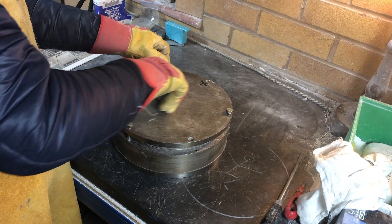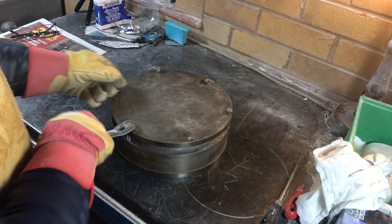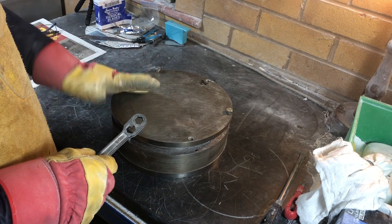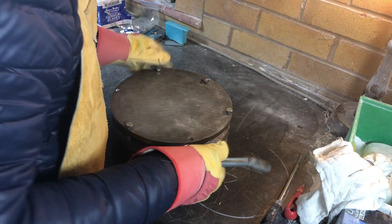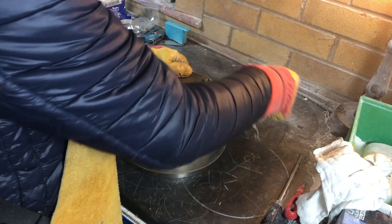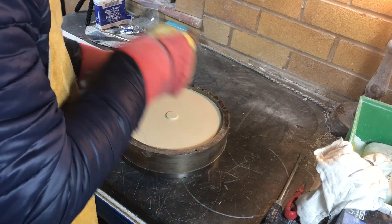The reason I'm doing this hot — and this is why I'm wearing rigger gloves — is that I'm hoping there's still enough stick between this top plate of the mold and the actual silicone of the mold to pull the rubber out still attached to it, which makes it slightly easier to get it out of the can. But I think it's actually just released, so take it off.